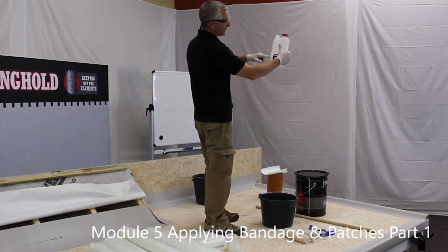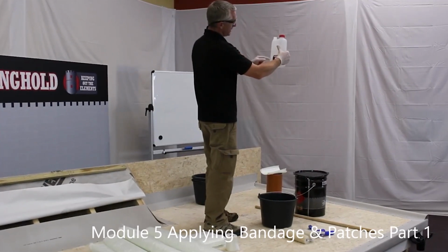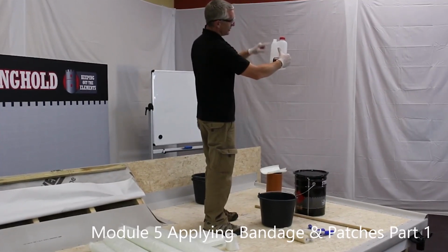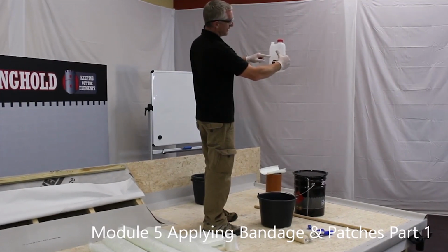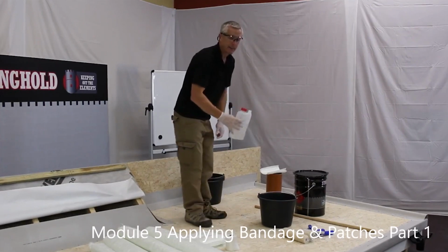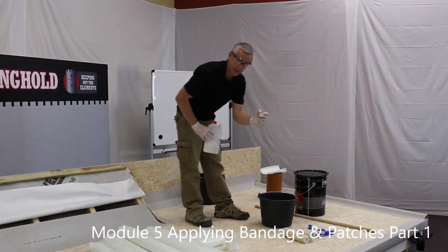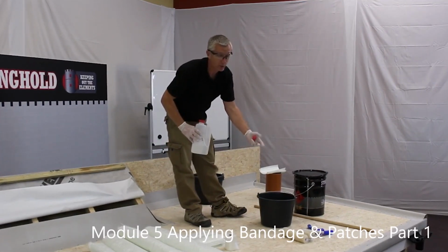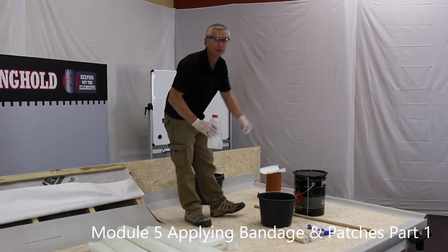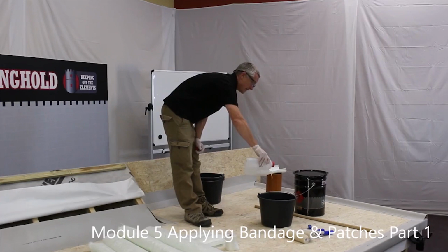The Stronghold catalyst dispenser has a grade on the side. If you take off the small cap, squeeze the bottle, see it rise up to about 20 millilitres, and then pour it in. Yeah. When we pour it in, it's a bad idea to have your head over it because it can sometimes splash back. We don't know how, but it can splash back higher than the pouring level. So always keep your head away from it.